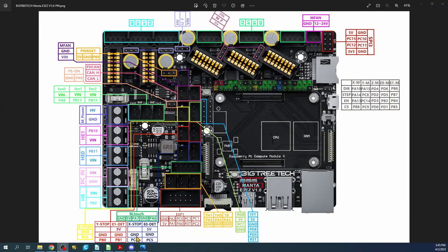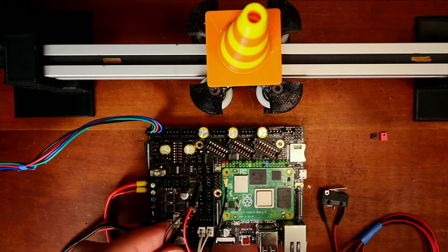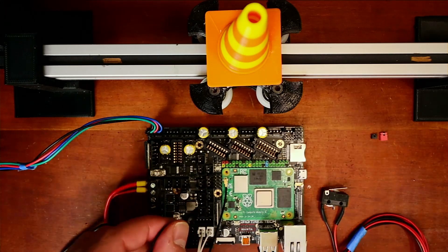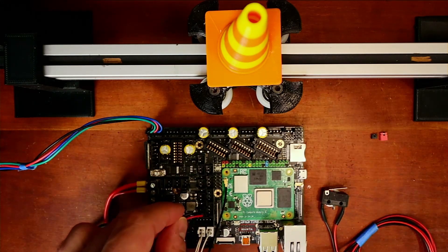On the desktop, we have our X stepper — the actual signal pin in this case is PC4. If we trace this up over to the right, you can see this is our X stepper. I'm going to pick up the actual connection for the end stop — the red is going to be your signal and the black is going to be your ground.